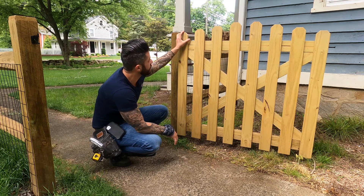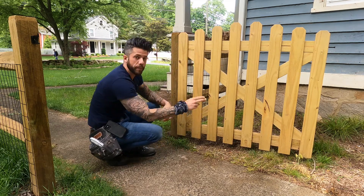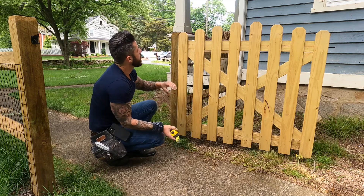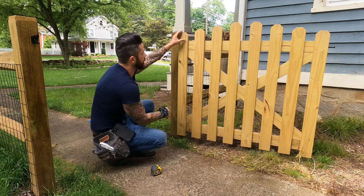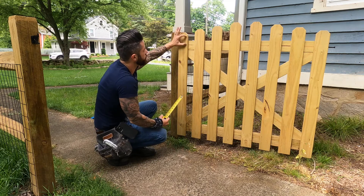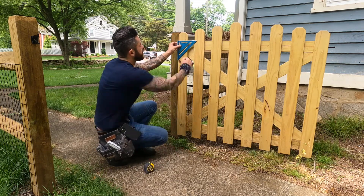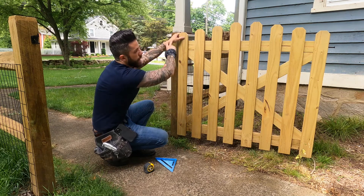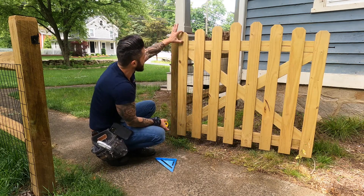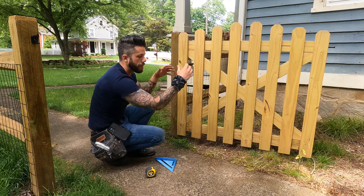Now that we have all our sizes, we're going to start laying everything out. Your horizontal 2x4s are going to be 47 inches, and your pickets are going to be 41 inches. Lay this down on a flat surface with your two horizontal 2x4s. This is personal preference — you can alter these sizes — but if you want to make exactly what I did, measure down three inches, take your speed square, line over, and nail your end pickets onto the horizontal 2x4s. About three inches here and two inches here. Once you do that it'll form an actual square — that is going to be the base of your gate.